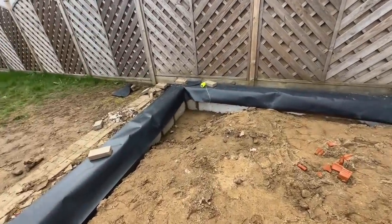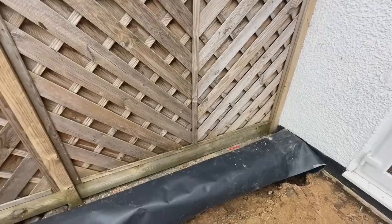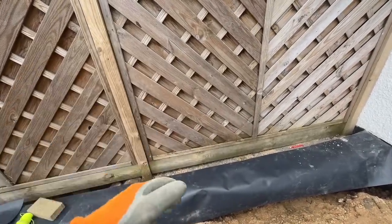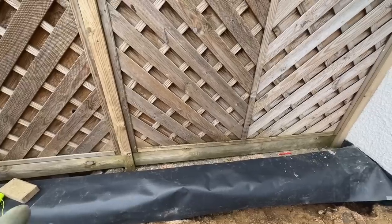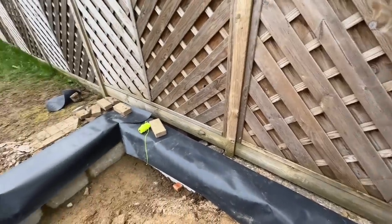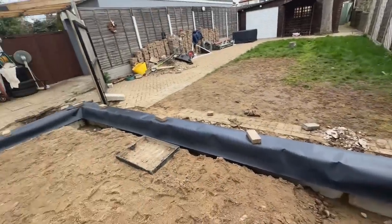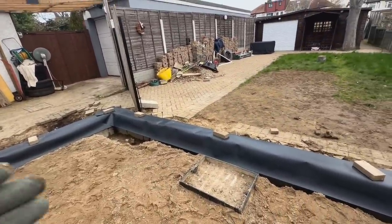Basically these beams are like large bridges, so they're essentially hollow underneath. There is soil underneath, but they're not being supported in the center. And the weight of the walls, the roof, etc., is sitting on this beam. So it's very similar to using a steel beam across a doorway, or a steel beam in a foundation that you can box in with concrete. It's a similar sort of thing. There is steel rebar inside these beams as well, and they're compressed and very high strength. So that's basically why we've done it this way. I will try and see if I can show you guys on the drawing the design of this, and you'll see that we basically copied what's on the drawing.